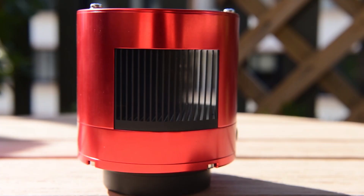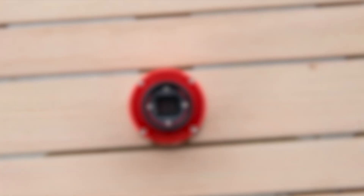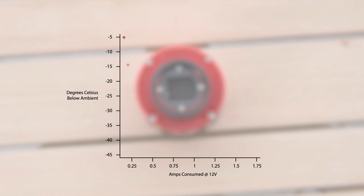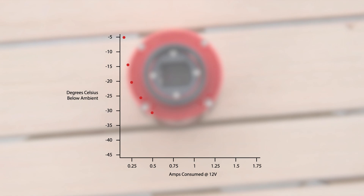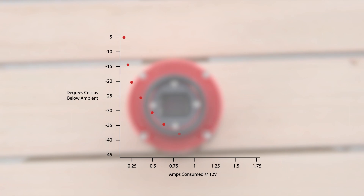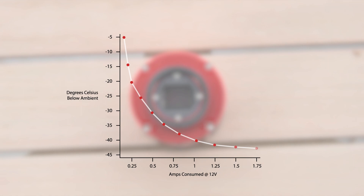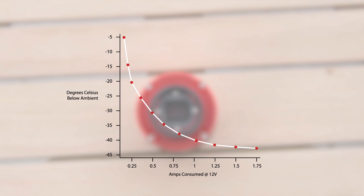According to ZWO guidelines, this camera can cool 35 to 40 degrees below the current ambient temperature. I personally haven't pushed it above about 30 degrees below ambient, but I believe it could go a little more, especially with favorable humidity conditions. This graph shows how much power the ASI 294 needs to cool itself effectively. You can achieve about 30 degrees below ambient using only about half an amp on the 12V, which is great for battery use. However, this doesn't scale linearly — another 5 degrees takes 0.25 amps more, and another 5 beyond that takes half an amp more, bringing you to about 1.25 amps total. This is fine on mains power, but could cause issues if your battery isn't large enough for an all-night session.